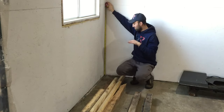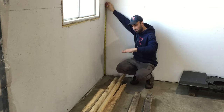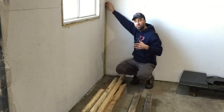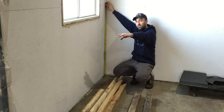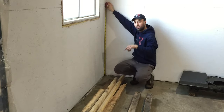I'm right here in the corner, and I believe this is the highest point of the concrete just by looking at it. What I marked right here is 34 inches and a quarter. Now I'm going to get my laser and shoot it over to the other side, make a mark over there, and maybe one more in the middle, and then we'll get the first 2x4.